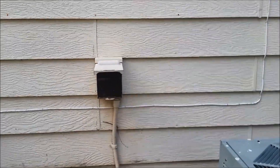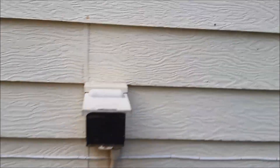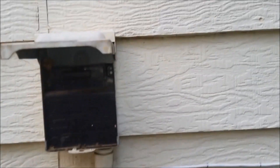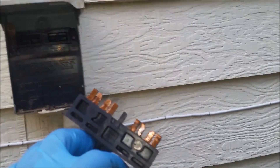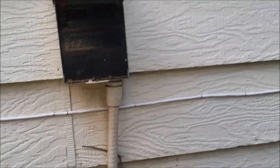The first thing you do when you start working with an air conditioner is a very simple thing. You can go to the breaker switch and turn it off, but any air conditioner has to have a breaker switch next to it. I'm taking it and just pulling it — and that is the breaker switch. Now no electricity can come here, and we can work safely.